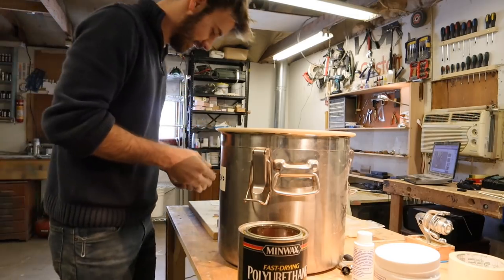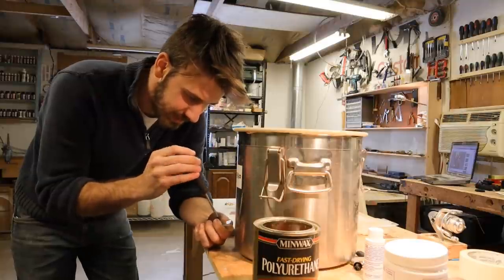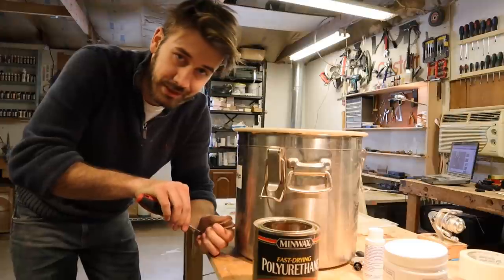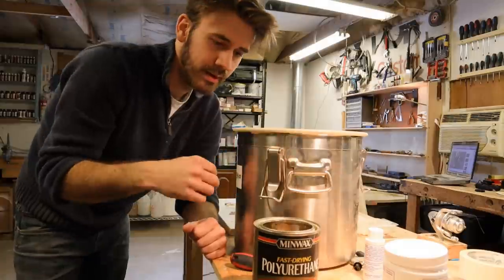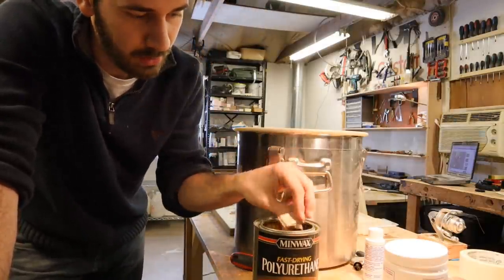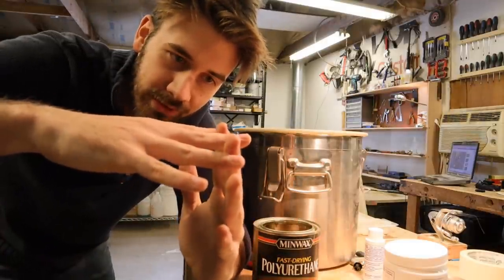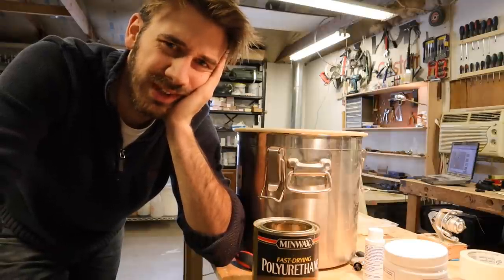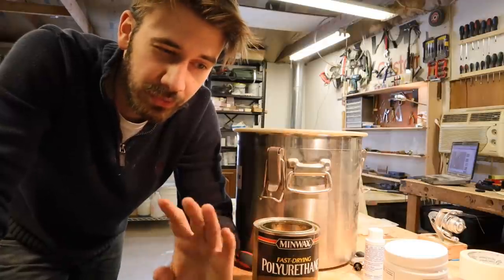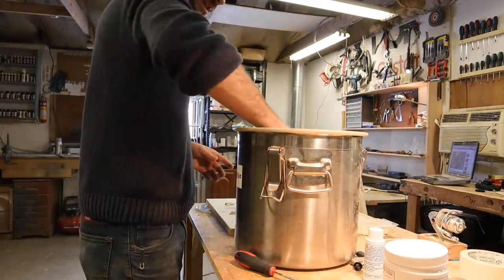Taking everything apart means the pieces can get a polyurethane vacuum bath. While getting this ready, I might as well spill the beans - I've changed my mind again and decided on something completely different for the gears. Somebody commented a good solution would be more of a wheel and pin system: a brass wheel with a bunch of pins sticking out, and those pins contact each other at a 45-degree angle and turn. I thought that sounded good because I want to use brass for strength but without having to make full brass gears. I'm going to call them pinwheels and try that.